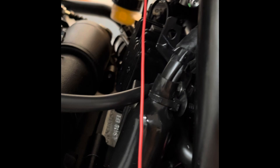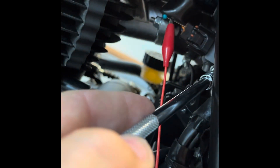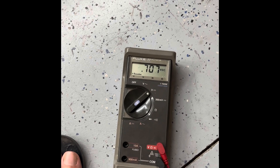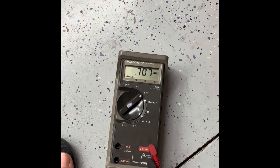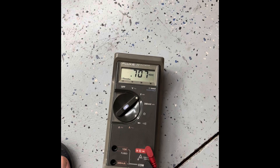We're at 0.713 — I think I'm going to go with that. I'm going to tighten the torques down. I ended up at 0.707. You have to be careful when you're tightening it if you're looking for an exact setting. I'm going to go with 0.707 because I would want 0.71, and 0.707 is close enough.